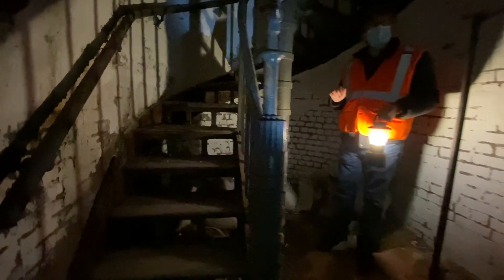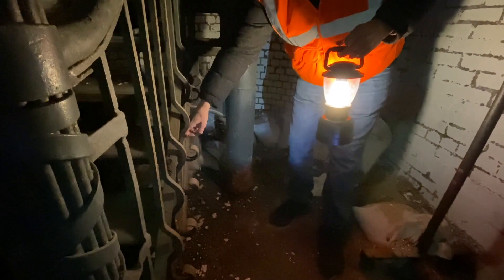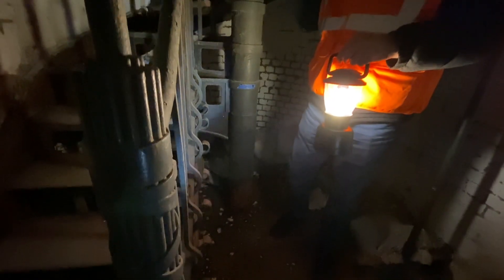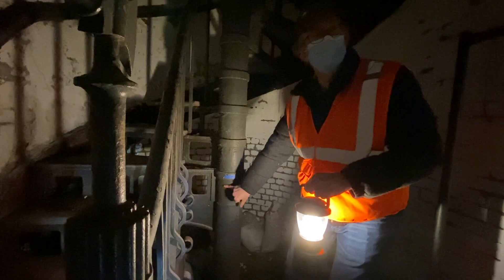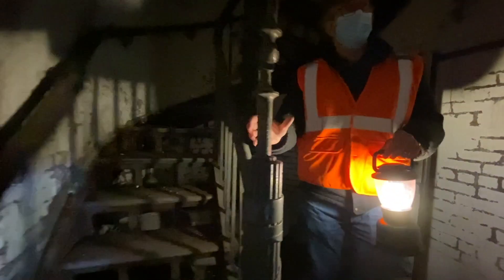Are you imagining you have to recast this whole staircase? No, just the pieces that are damaged. The pieces with the most damage are the stringers attached to the brick. The stringers that are open air are fine — they just need to be sanded, scraped, repainted. But to replace those damaged stringers we're going to have to unstack this entire staircase, since each piece is stacked on the one below. We start from the top, pull them off, replace those stringers, and then put them back on.